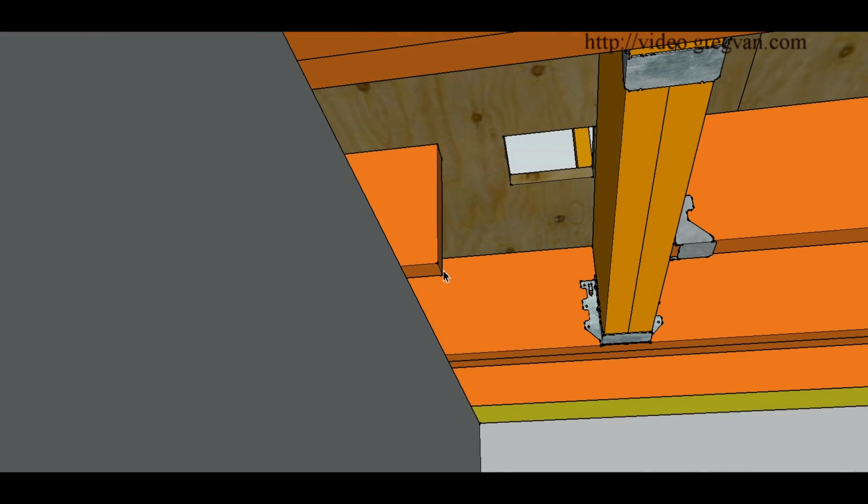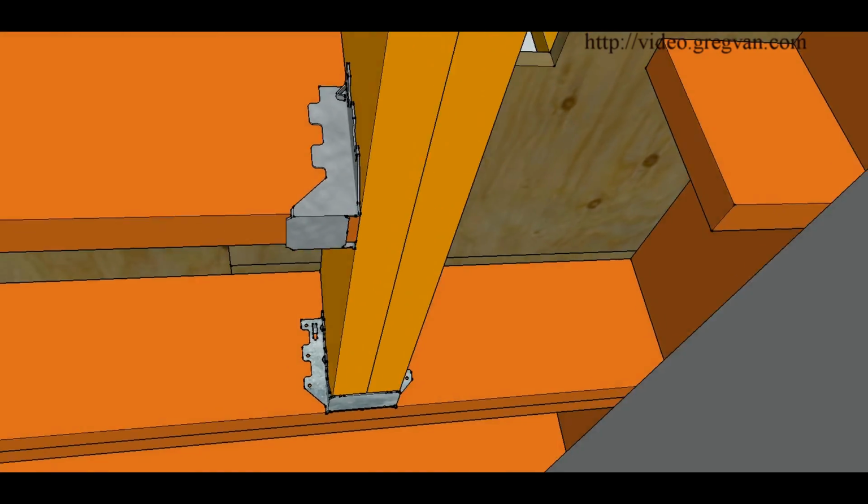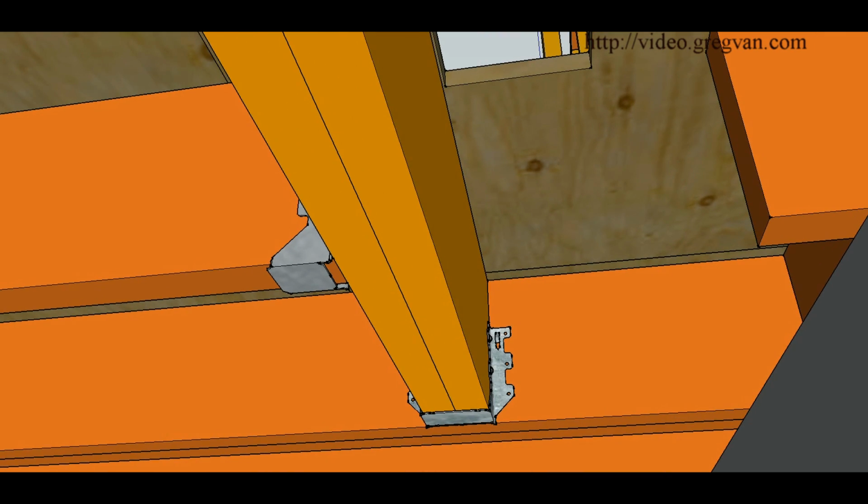Now you can always put another board here. For something like this, you might not need a doubler, and you might even be able to get away with just toenailing it into the doubler over here and then end nailing it in here. So you'd basically just be taking one of these blocks and moving it over to here. You'll see another example of that, I believe, in the next video, where I have two doublers in there when I move it over. There you go. That's it for this one.